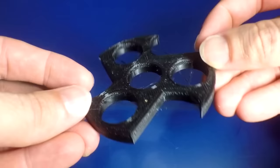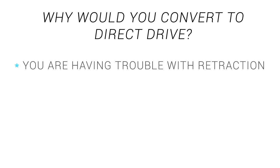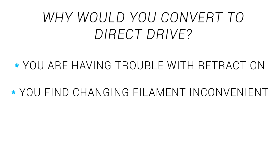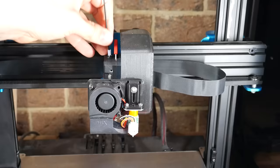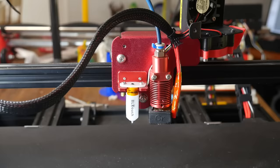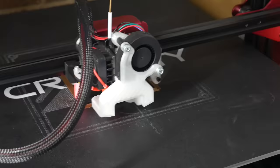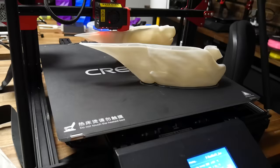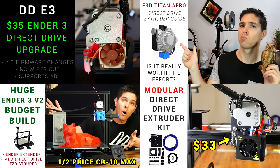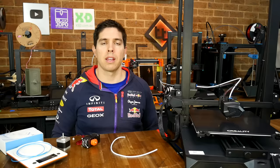So how about the opposite — why would you convert to Direct Drive? The most obvious reason is if you're struggling with retraction, and the Tronxy I showed earlier would be an ideal candidate to go Direct Drive. There's also the added benefit of more convenient filament changes — with Direct Drive, this manual process becomes a lot, lot easier. And finally, on an i3-style frame with a moving bed-slinger Y-axis, that heavy bed mass is going to be our limiting factor anyway. For example, on the CR10 Max, I removed the factory Bowden tube setup and instead fitted a much heavier Hemera. Have I limited the speed? Absolutely not — what really stops me from pushing speed and acceleration is that really heavy moving bed. Any ringing is going to come from this way before the extra weight from the Direct Drive. The same goes for all of the conversions I've done on the channel — each printer is different, and performing a conversion may or may not be a good fit.